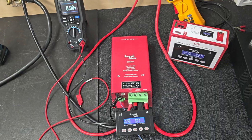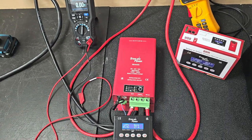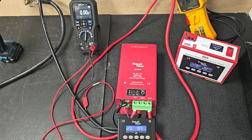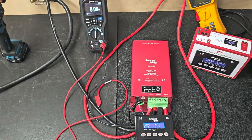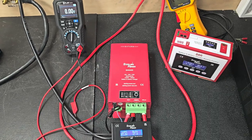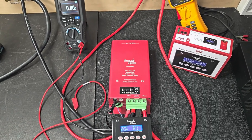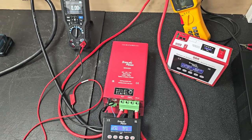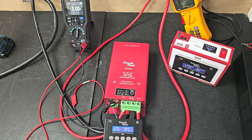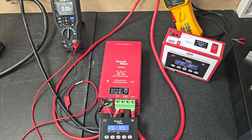You can't just put 54V directly onto 42V — that's a 12V differential — and the floodgates of current will open up and inevitably your BMS will just turn off straight away inside your lithium iron phosphate batteries, therefore tripping the BMS on both the discharged donor battery and on the receiving BMS on the recipient battery.